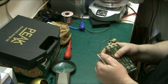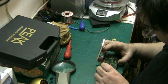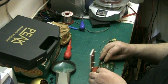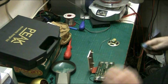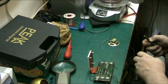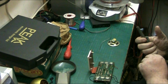Let's lift that VDU thing up. The display, and I'll check under here for dry joints and stuff as well. But the capacitors really, given that one of them's really out of spec, they need to be replaced. Ooh, big lump of solder in my sucker. There we go.